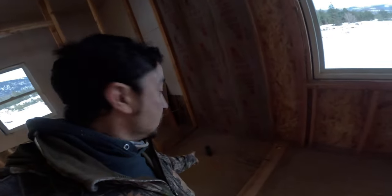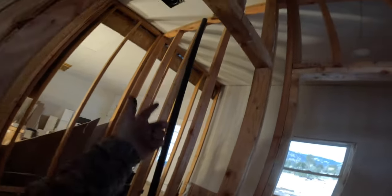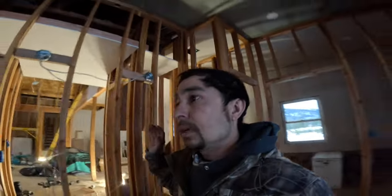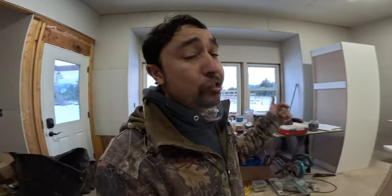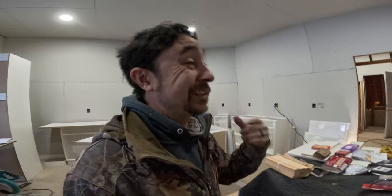The kitchen we did not do yet because we're still trying to figure out the exact loop vent that needs to go in there — we need to do a little more research. Out here we have the venting and drains for the bathroom vanity, and we just need to run the vent pipe up to the roof. We've got the line stubbed out for the shower and the line stubbed below the floor for the bathtub. The toilet vent is hanging loose because we still need to run it up through the attic. We got about half of the main three-inch drain lines done under the floor.